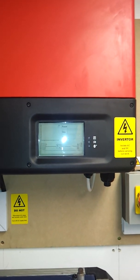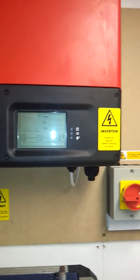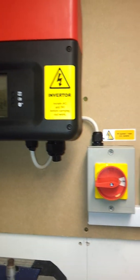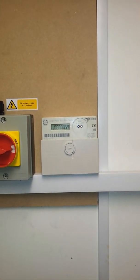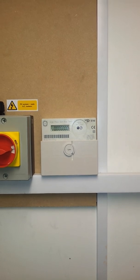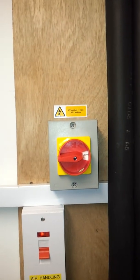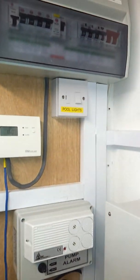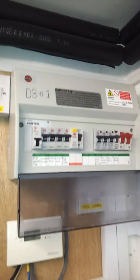Moving across — it's turned on but it's basically dark outside. You can see the AC coming out there, going into the first main AC isolator on the right hand side, across into the single phase watt-hour meter, trunked along into the second main AC isolator, and then carrying through in the trunking up to distribution box number one.